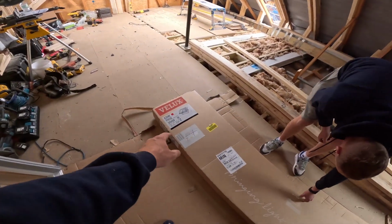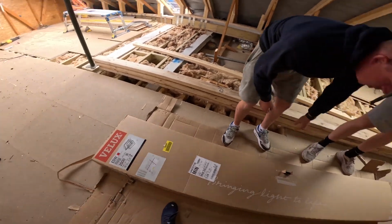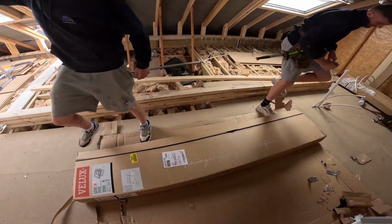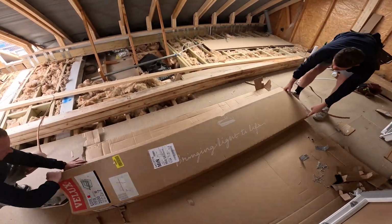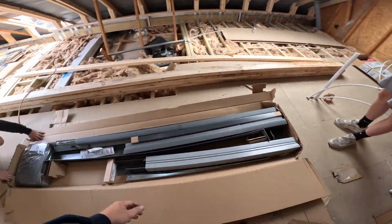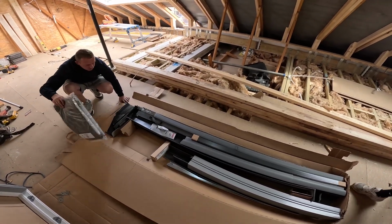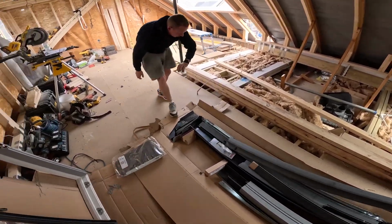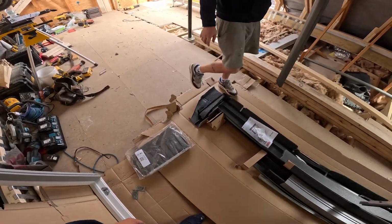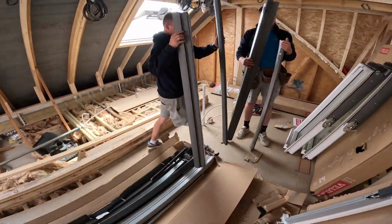Flashings now. So this one again is the new 2000 flashing. It comes with the BDX and the BFX kit, which is the felt collar and the insulation collar, which has always been available, but a lot of people have chosen not to fit it, to be honest. It's part of their good practice products. But now they've decided to make it standard that every flashing kit, the new 2000, is becoming the new standard 1000 flashing, if you like. So every time you order, you should be getting a 2000 unless specifying something different.